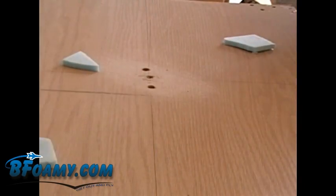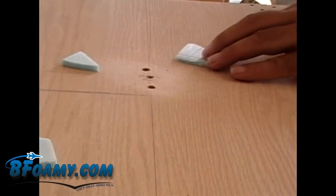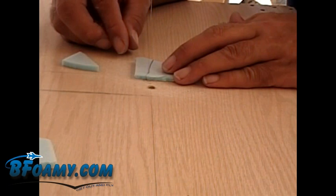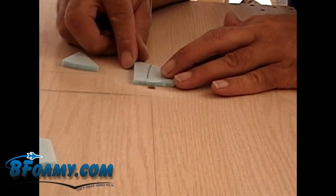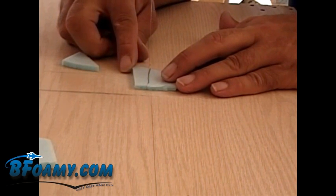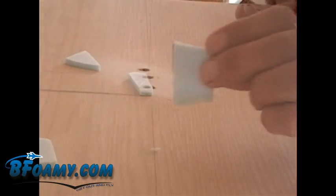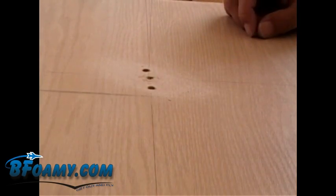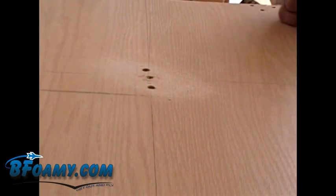Let's draw a line on this and see how I do following the line. My line was a little crooked, so I'm sure this will be kind of crooked too. It cuts through pretty good — it's a 32 gauge wire. I could probably put a little more tension on it, but it had little bends in it where it was rolled, so I just wanted it to straighten itself out. As time goes by I might tighten it a little more. It's got tension on the spring, so it's good to go.